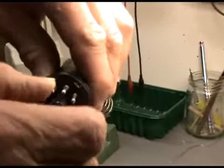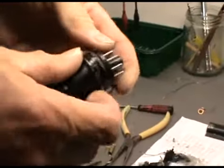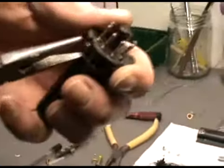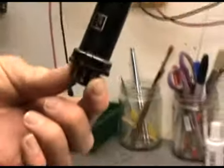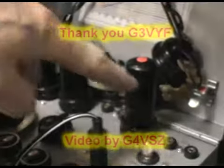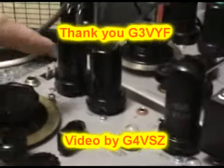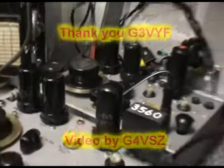That is ready then for fitting over the top of the transistors. When you put the transistors in, you put the base back anywhere you like — you can use the old positions if you want — and then using a pair of long-nose pliers you push the swaged part back in until it grips the body. And now you can have some transistors — there are three of them — that look just like the real valves. You can't tell the difference, apart from the coloured spot so I know what they are.